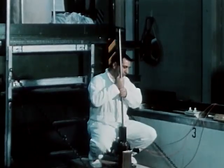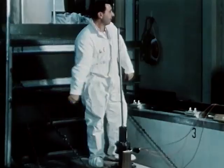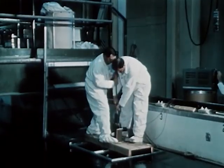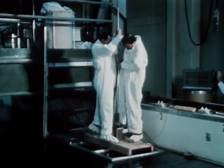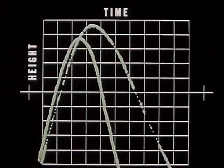To test empirically that this is possible, a control rod drive mechanism was assembled over a pool of water and attempts were made to withdraw the rod with reasonable efforts and maximum efforts. Similar tests simulating stuck mechanism conditions were also conducted. All data were recorded on an oscilloscope. It was concluded from analyzing the data that an average man could withdraw the blade fast enough and far enough to reach the observed 20-inch final position before steam generation terminated the power excursion. The experiment further showed that a 20-inch withdrawal would not likely result from trying to free a frozen rod assembly.